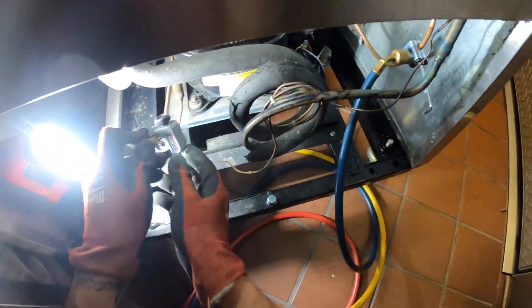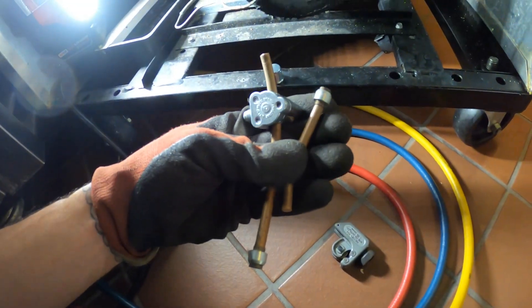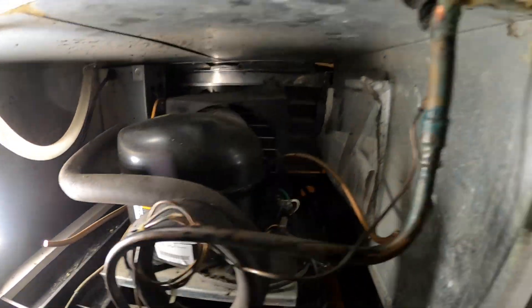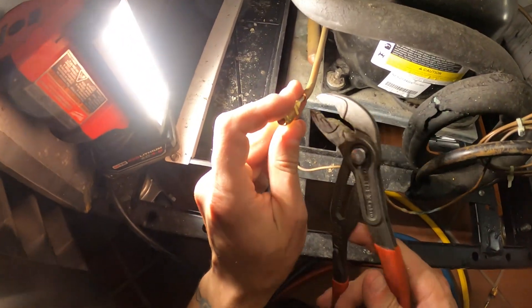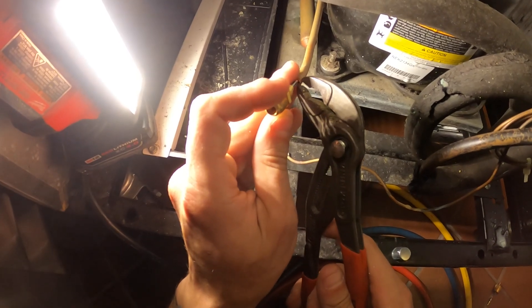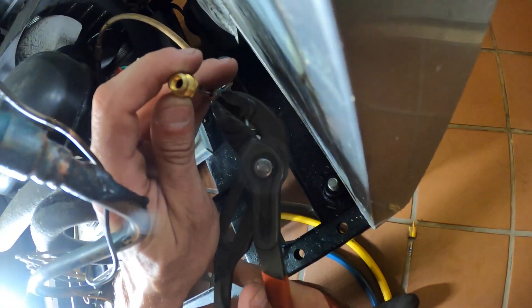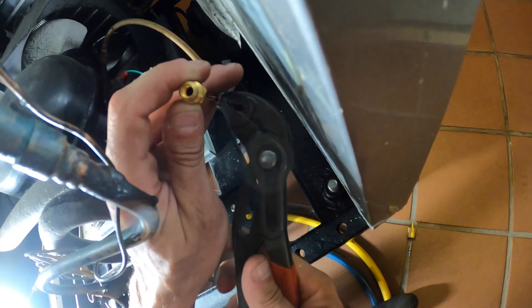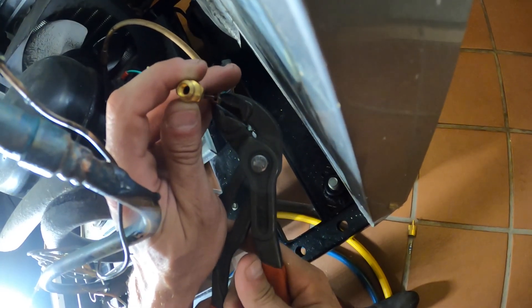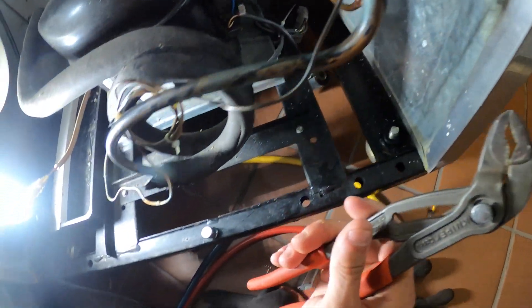We should have the high side here and the other one will be the low side. Cut this out of the way, stick a pigtail in there and one in there. It's a pretty good connection, but I will crimp it on the edge a little bit — and the same thing for this one. You've got to be careful so you don't crimp the actual pipe, because that's going to be breathing pressure. I just want to crimp the excess of it.